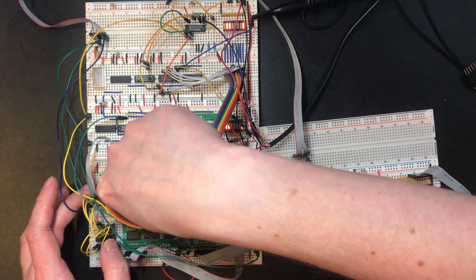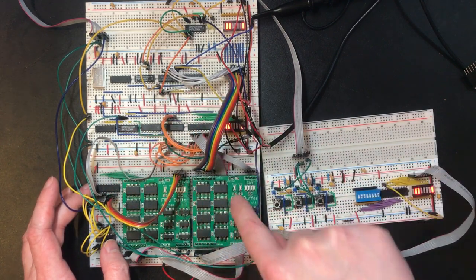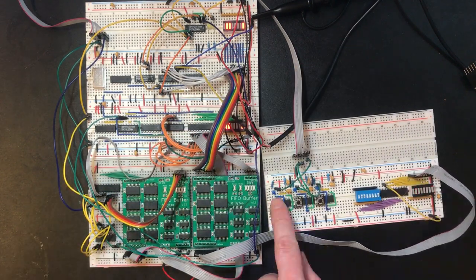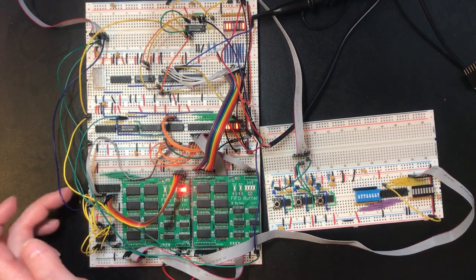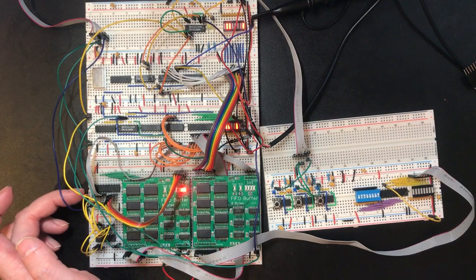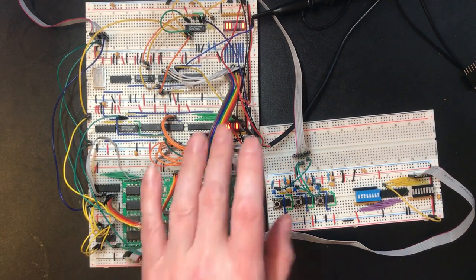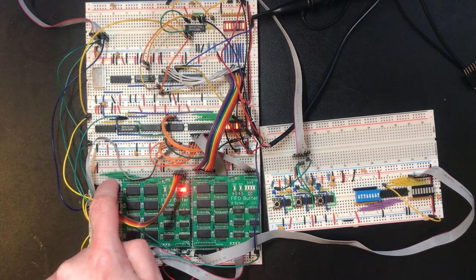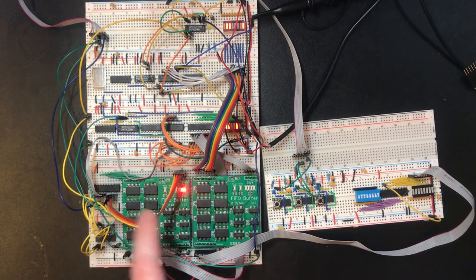I put the line driver in here, and the idea is to output the data containing the counts from the two FIFOs onto the bus on demand. So we do a status read, and the count comes out on the bus when we select it. But I've been worried about this because I believe I've got a flaw in the circuit. And that's asking the question, what happens if a byte is received or finishes transmit during the read of that circuit? This would change the signal being asserted on the bus midway through the load operation. And that's really not good.